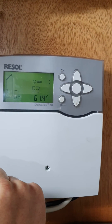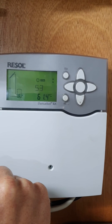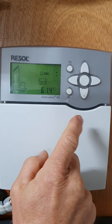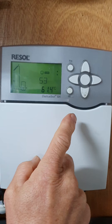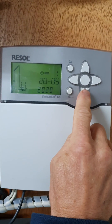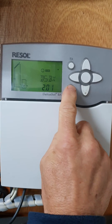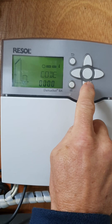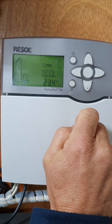If the top-of-tank temperature gets down below 40 to 45 degrees, you're going to want to boost it — probably a manual boost with your electric element. That's a basic overview of the Resol BX controller. All the other functions and settings on here are irrelevant — don't touch any of those.